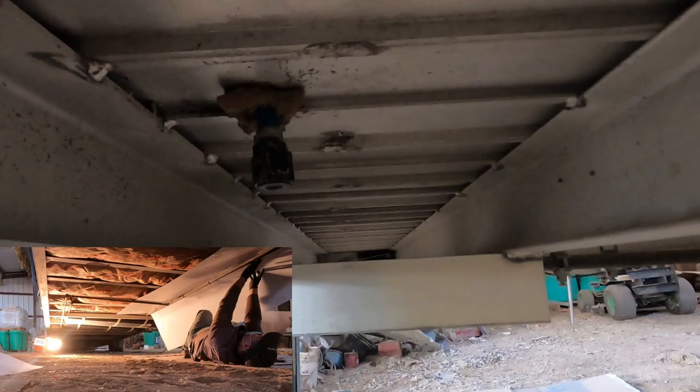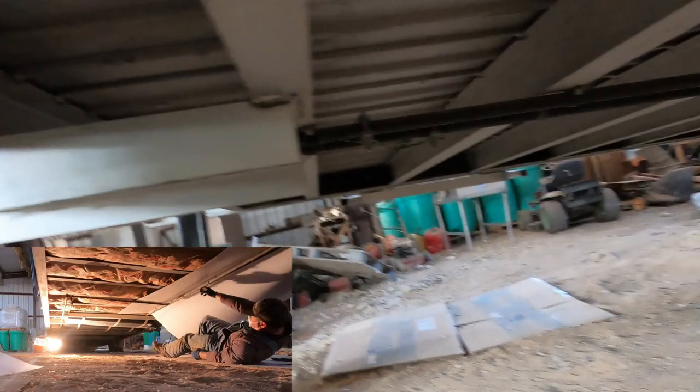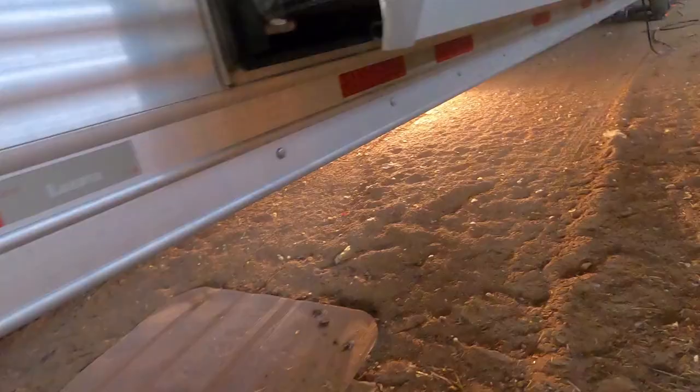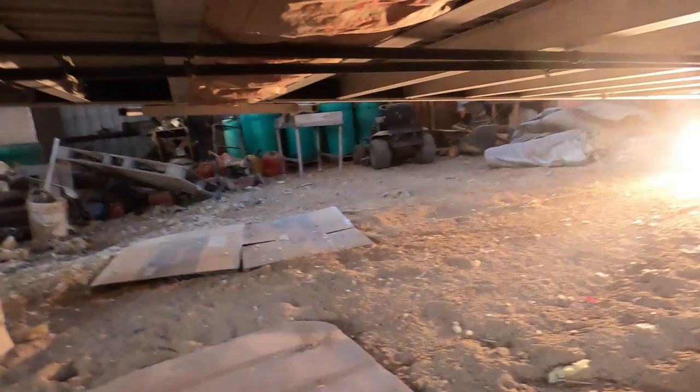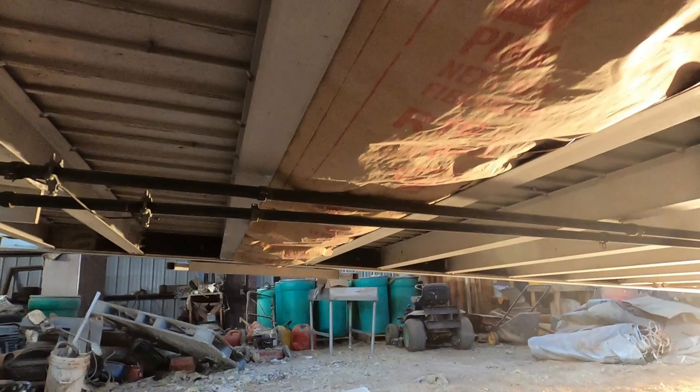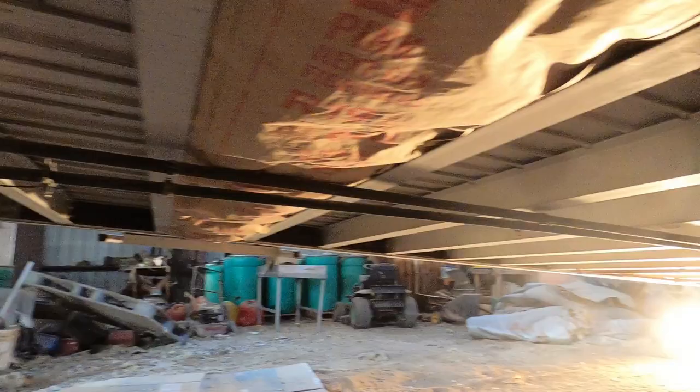This first row is going to be a doozy — we've got a support beam and some gas piping. I'm going to unscrew the supports to that gas piping and drop it down just a little bit so we can slide the sheet in underneath it. I got some screws undone and went ahead and cut and put the first piece of insulation in. I cut it long to be safe but it was definitely too long, so I'll bring it down about two to three inches shorter.